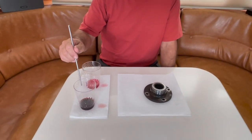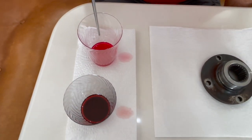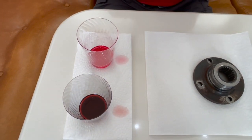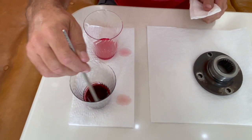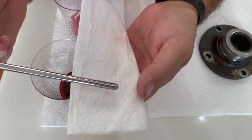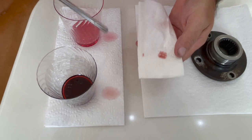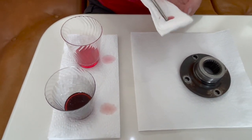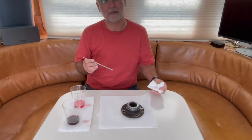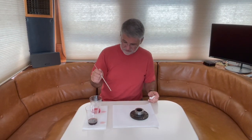You can see the transmission fluid I pulled out compared to what new transmission fluid looks like. You might be asking how I possibly didn't catch this — but when you see it on a dipstick, it looks clear, it doesn't smell. Every single time I did an engine room check before we started up, I'd dip it in, look, it looks great, smell it, wipe it off — it looked red. I didn't realize there was particulate in it. So I've been pumping the particulate of this 24 thousandths of wear through the transmission. Tracy asks whether the particulate could have settled to the bottom so it wouldn't show on the dipstick — yes, that's a great point.